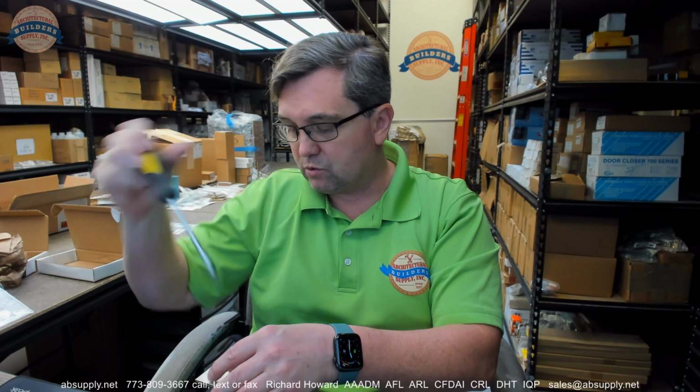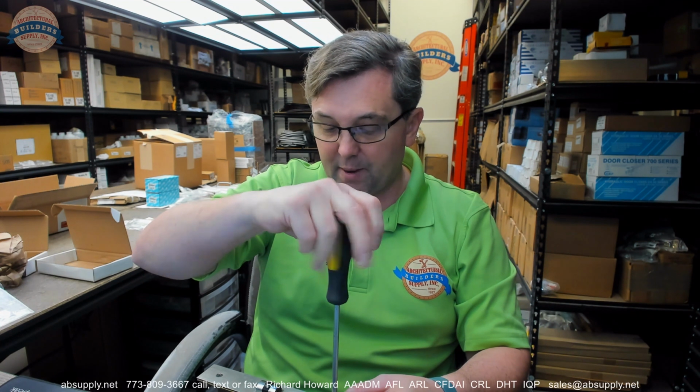So what's missing from this order going to this client is a template. And admittedly, for people who deal in commercial locks, installation of that material is nothing other than, okay, I just need to get the template. There are no installation instructions with a lock like this. It does have to be ordered as a handed lock, in the sense that there's nothing handed about this lock case, because you can install the cylinder and the thumb turn on either side, but that strike is sure-handed, okay? Because it's standard convention that the deadbolt will be towards the top of the door, right?